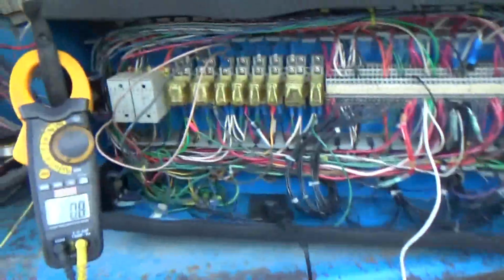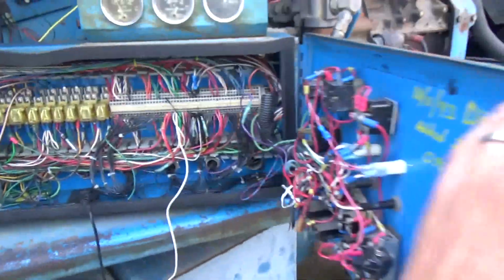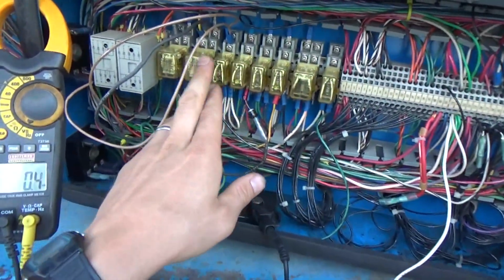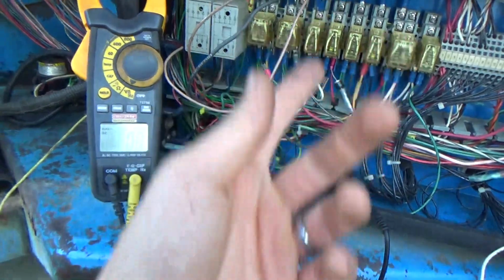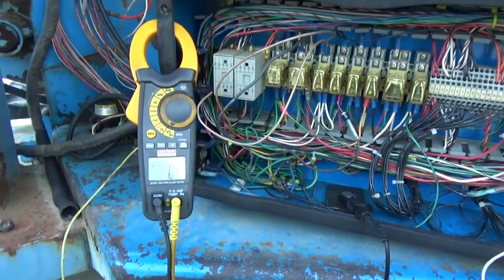This thing's so consistent. Anyways, the oil pressure switch seems to be funky because we lost this and now it stays running. It's either not fully grounding or fully letting go of the internal contact. So I think we should get to the oil pressure switch, unplug it, see if our wiring integrity is good, and then just tell them to replace the oil pressure switch.